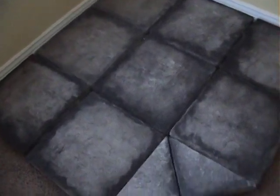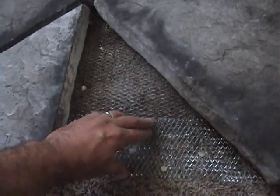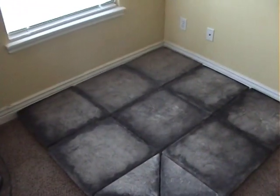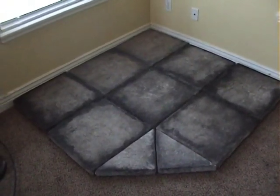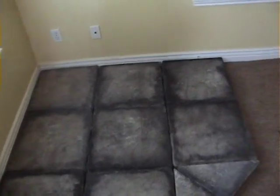I've got all the stones laid down and I haven't cemented them in yet, but I just wanted to show you how I laid it out. We've got this metal lath underneath and I doubled it up — I just nailed it right to the carpet. I'm going to put about a half inch of Type S mortar and cement these down. I've got three going one way and three the other way, and then 45'd across the front. I'll show you the finished product when I'm done, along with grouting in the gaps.